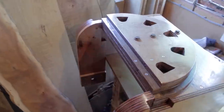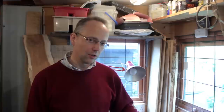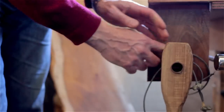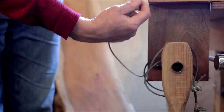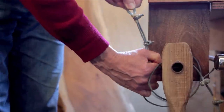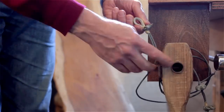We've got the actual main assembly now made up. I've put the box construction together with the side bends and the main top arch bend, and I've put a lot of varnish on to give it good protection from the steam — using a high-grade exterior varnish to stop any steam penetrating the ply and make it last as long as possible. The windlass just slots into these drilled holes — it's simply a metal bar with a wooden lever on it. There's a wire strap that winds around the bar, and as you turn the lever it pulls it down. It has an eyelet on the end that hooks onto the bending strap, and you can get colossal force to pull the bent wood down — very simple but very effective.